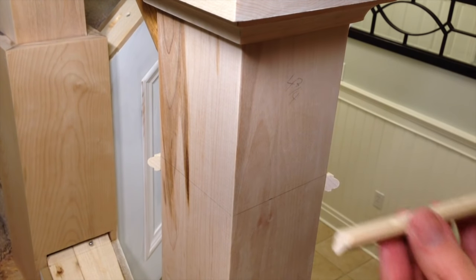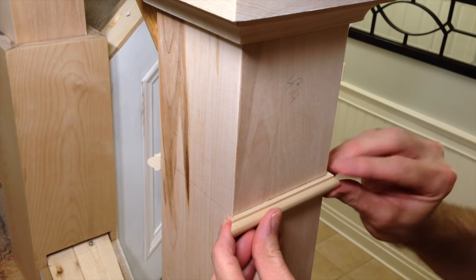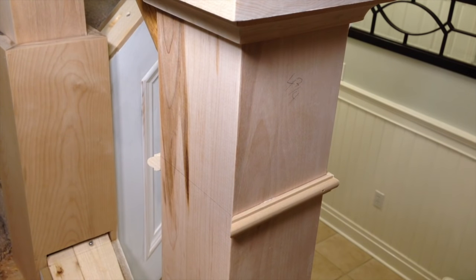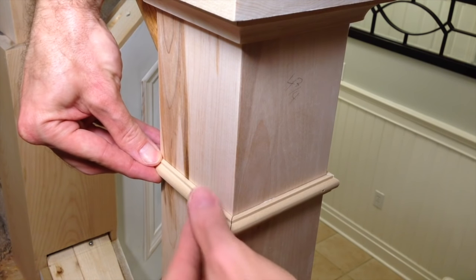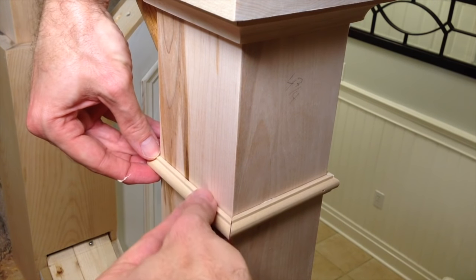With the last piece fit, just a little dab of glue. I line up this joint to where I want it up to the line, nail it on the back end, then put a little bit of glue on the end and line up these pieces. The reason I glue these miters is just to give them a little extra holding power and encourage them to stay together.